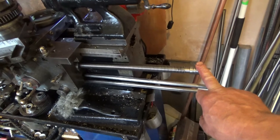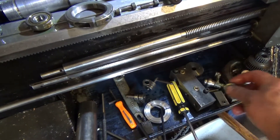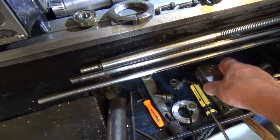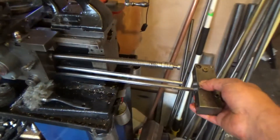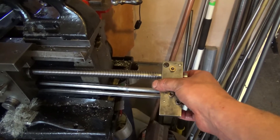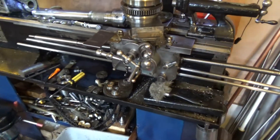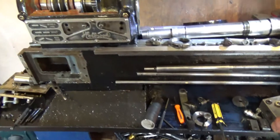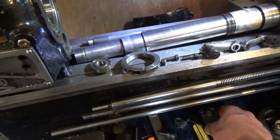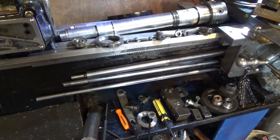That wasn't a bad thing — it all happened just right. I've been pretty lucky because this rear bearing here was very tight — very tight indeed. Here's the bearing block. I got it out by using the saddle to push it out — I engaged the half nut and pushed it out, taking the bearing to pieces at the end, and it was very tight. I've just sprayed some oil into the bronze bush, it soaked it up, and it's free as anything. I don't have to do anything to it — just put oil in it, let it soak in, and that was it.